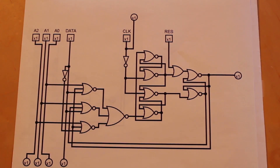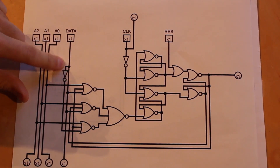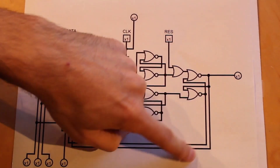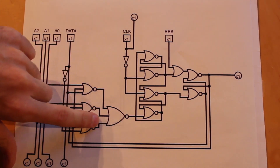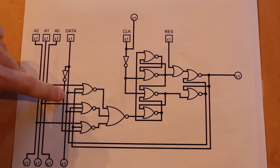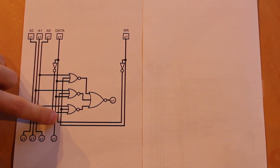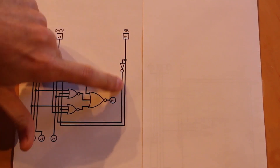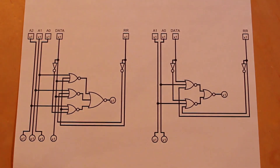This is actually a pretty simple logic unit to build — you can see it's just four NOR gates. But there's a lot of inputs going into it: we have data coming in, as well as the inverse data, the result register, and the inverse result register. We also have three inputs that are kind of like the address to select what function we're going to perform with the logic unit. So I wanted to simplify it a little further and build a proof of concept for our proof of concept, eliminating the result register.